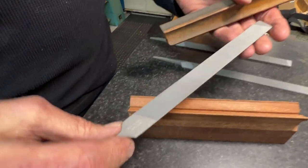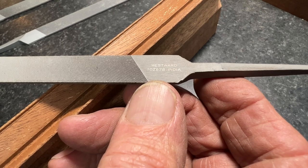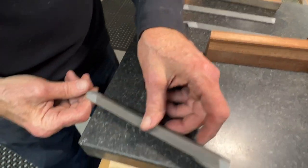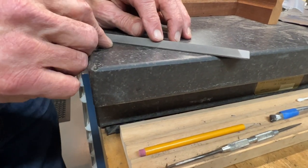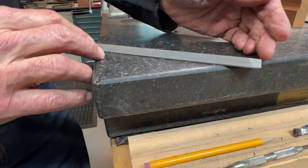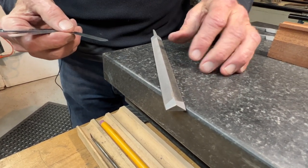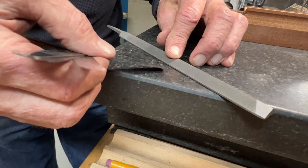These files aren't that expensive. These I sourced from a place called Westward, which says India — that's fine. You can buy a dozen of these for short money. One reason for buying a dozen of them is that they're all a little bit different. When these are hardened in manufacturing, they are slender in cross section and long, which makes it pretty tough to keep them perfectly straight when they're quenched in oil. They tend to warp a little bit, so it's nice to start out with a dozen so you can pick the ones you like.